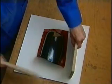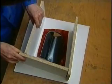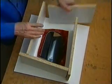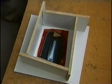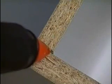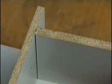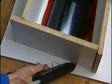The casting frame can be made rapidly and inexpensively from melamine-coated chipboards glued together using a hot gun. If the four walls that constitute the casting frame overlap at one side, the boards needn't even be cut to measure, but can be individually adjusted to the required size when building the frame.